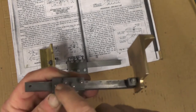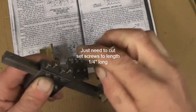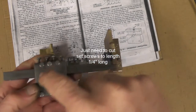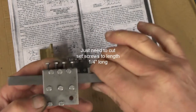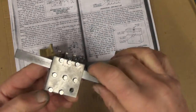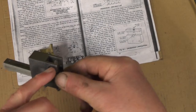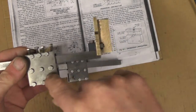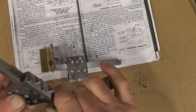Back at the workbench, just off camera, I've drilled the screws for adjusting the slipper — the bronze slipper that fits in the top. I did them off camera; it's exactly the same as doing the screws for fixing the cover, modified M3 bolts re-threaded on 6BA. Also off camera, I've drilled the hole where the conrod fits — the gudgeon pin hole — 5/16th diameter on one side, 3/16th on the other side. And that's it, now they're complete. I've got the lubrication point drilled in.